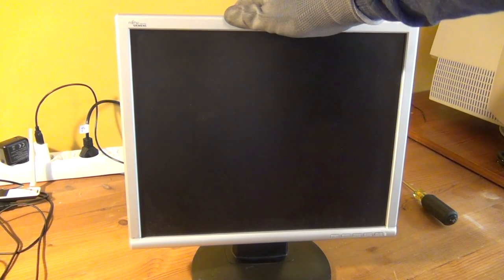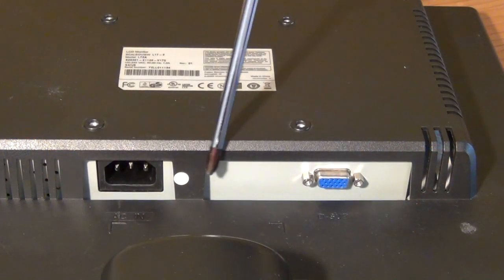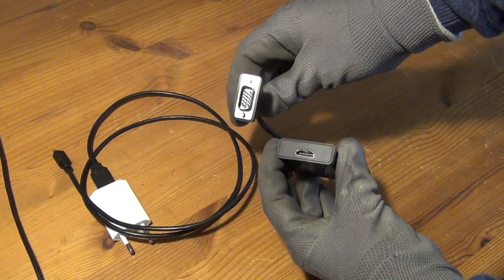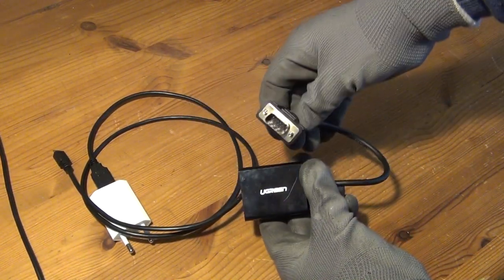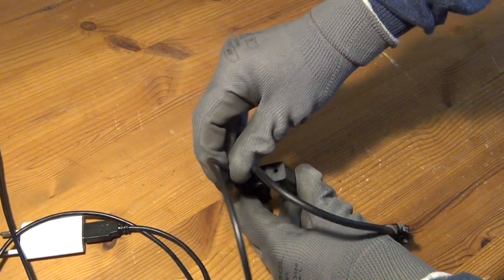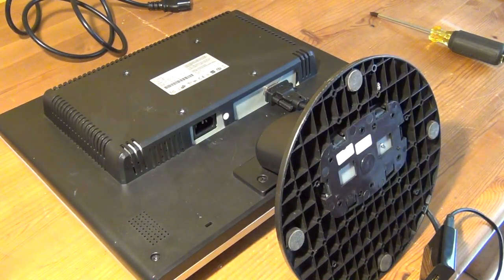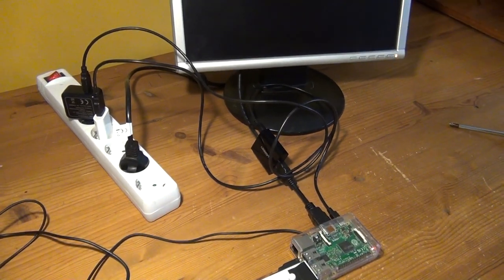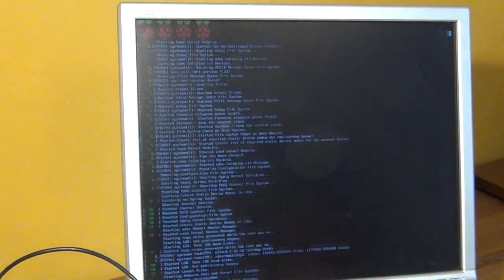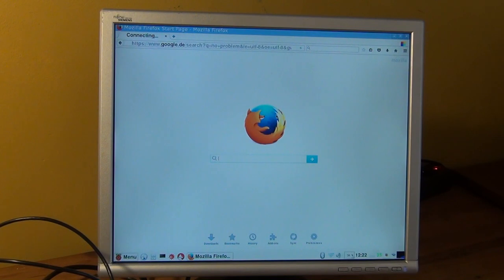The smaller of the two LCD monitors only has one VGA analog video input. To connect these two devices, we can use an HDMI to VGA converter, which I bought for around 10 euros. It needs its own USB power supply and also has an audio output jack. With some HDMI to VGA converters it is necessary to uncomment some lines in the Raspberry Pi's config file, but in this particular case with this converter and screen, it was not necessary.